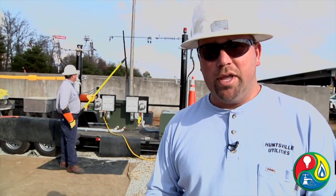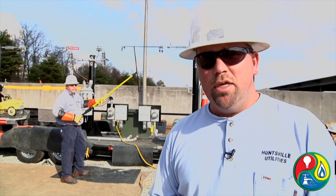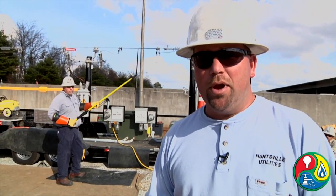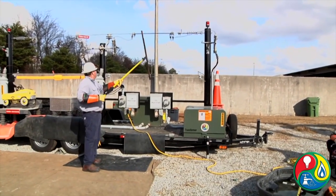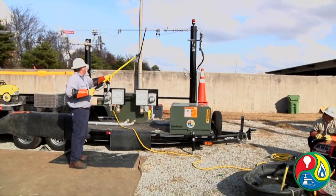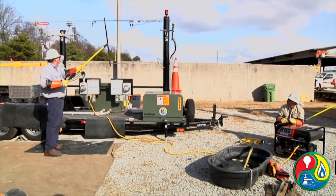If you're going to treat the line as it's dead and properly grounded, and you get up there and actually work, they're going to demonstrate with this piece of wood you getting in between a primary and a ground. Now, as you notice, as the generator is running, the breaker never trips. It's still showing load.